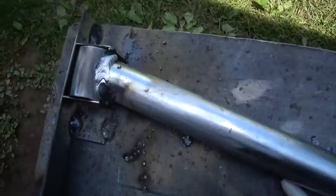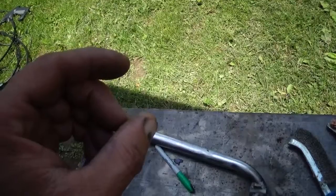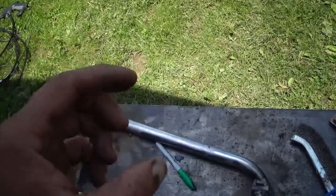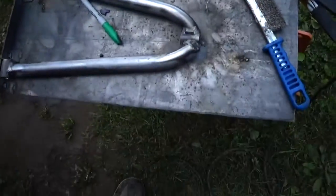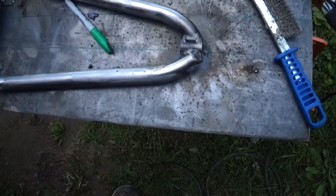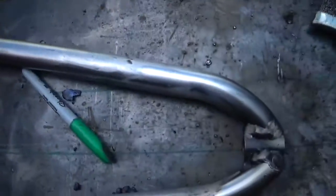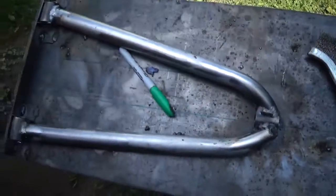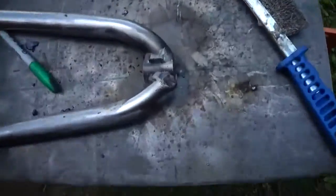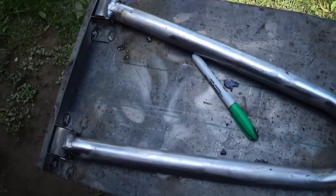I see a lot of guys notch this stuff out using a hole saw, like the little round hole blades. They're hollow in the middle and have a drill bit in the center. You need a drill press and ways to fasten this stuff down while you do it. I'm just grinding and cutting things off to get a close fit. So I'm happy with this. But alright, I've got 2 more arms to do.